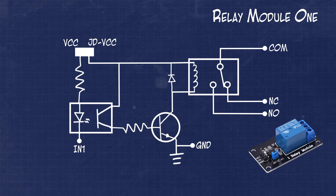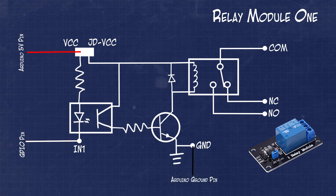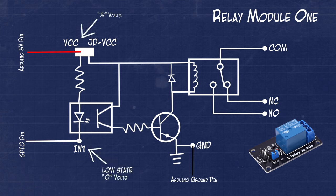In this configuration, we would connect our microcontroller's 5-volt rail to the VCC pin and one of the GPIO pins to the IN1 pin. Finally, we'll connect the ground pin of the micro to the ground pin of the relay board. When the GPIO pin is low, meaning there's zero voltage potential at IN1, then current will flow between VCC and IN1. This is known as sinking current into the GPIO pin. Our GPIO pin effectively acts like a ground pin for the connection to VCC. It is typically okay to sink current into a GPIO, but each microcontroller will have limits to how much current a GPIO pin can handle. In the case of an Arduino UNO, the ATmega328P's GPIO pins can sink up to 40mA max, but it's a good practice to keep the sustained amount under 20mA. The optocoupler only draws about 5mA, so this isn't a problem.